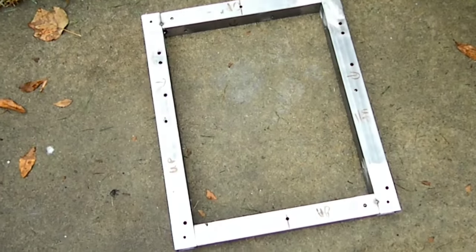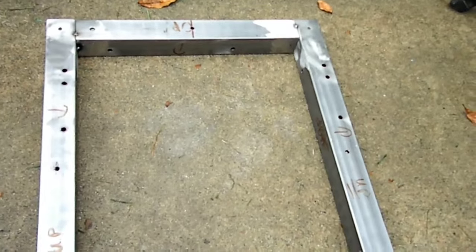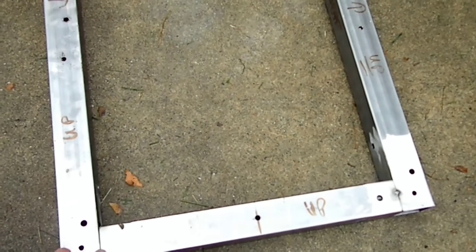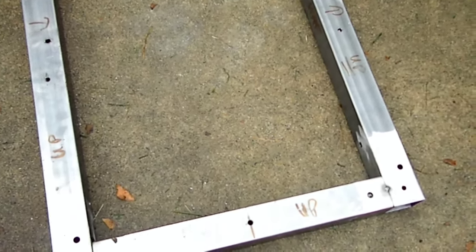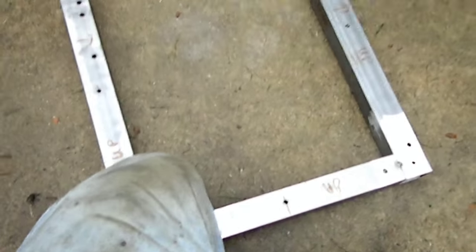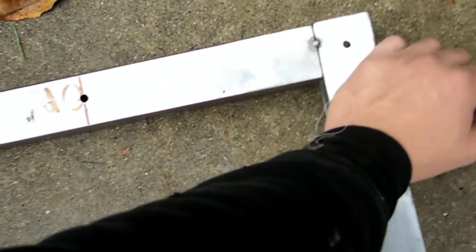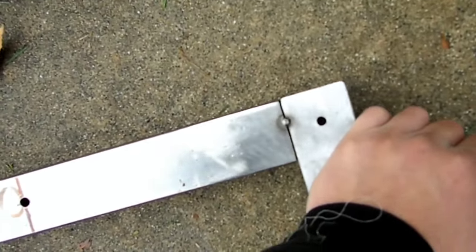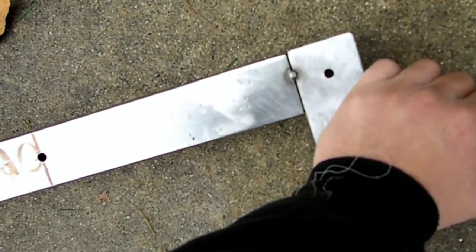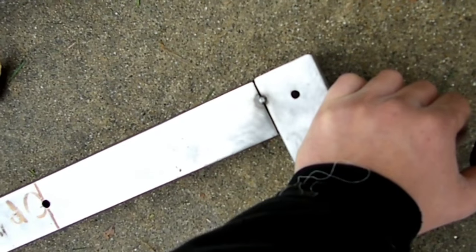So I'm about 3/4 of the way done tacking my pieces together. And at some point, my cart here has become warped, which is common. I sort of expected it to happen, and I tried to prevent it, but it still happened. But I can still fix it if I rest on one edge and then come over and push on the other, the pieces and parts that are warped or out of shape or didn't line up correctly sort of mush where they're supposed to. So I'm gonna have to get a couple more tacks this way, try and flatten it out. That's what we'll do next.